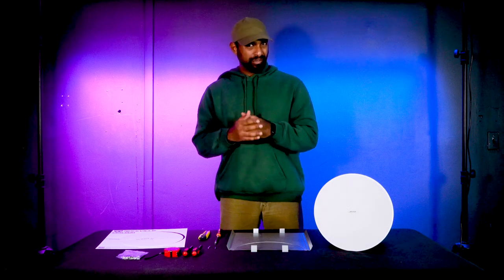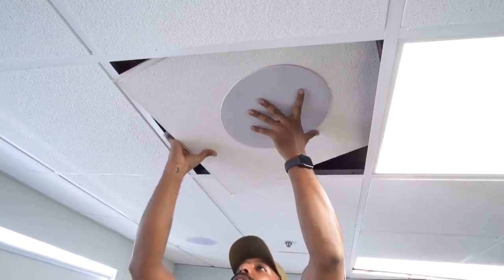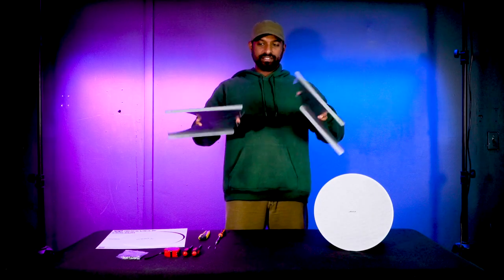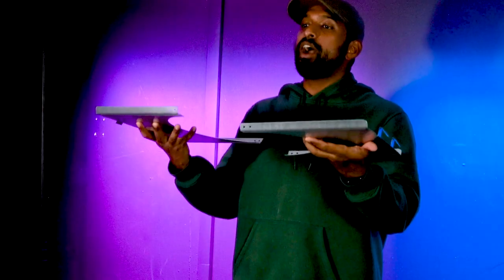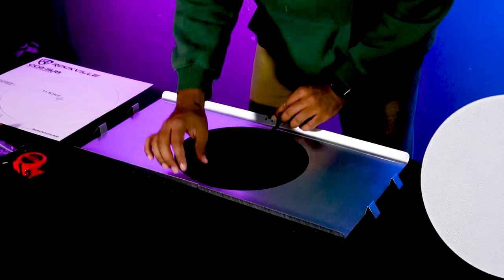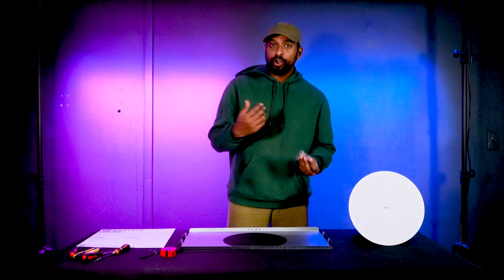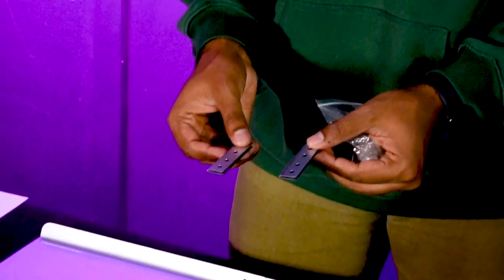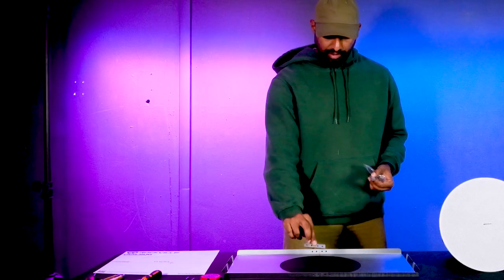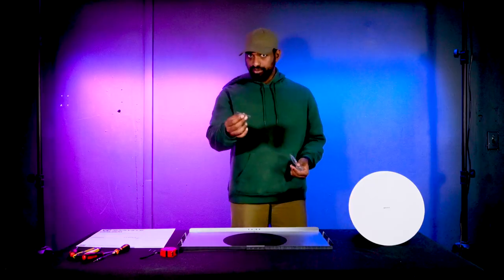For the alternative method, we start by setting up the mounting bracket, which supports most of the subwoofer's weight on the drop ceiling tile. Take the two halves of the bracket — always with the walls on the sides facing upward — and line them up connecting in the middle. Then grab the two long bracket pieces from the hardware and place them over either side of the bracket walls so all four screw holes are clearly visible. Do the same on the back piece, sandwiching it in.